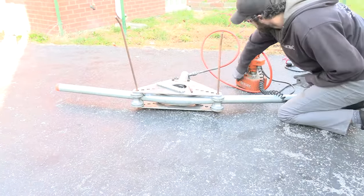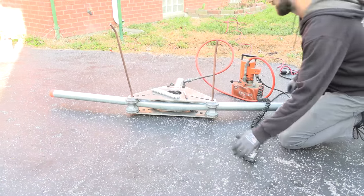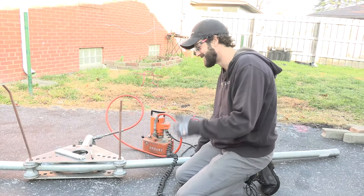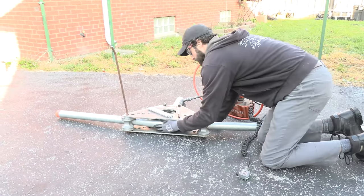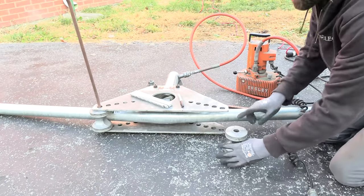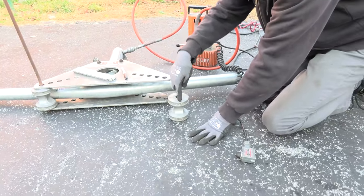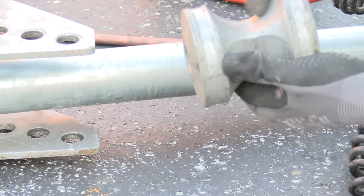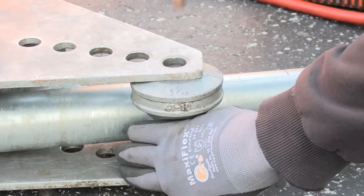All right, release the pressure. And my ground rod's held. That is so unprofessional. All right, pressure on the head is slowly coming off. One thing to note is, this is just Sharpie down here, but this has got 4 settings. It's for 1 inch, inch and a quarter, inch and a half, and 2 inch, and I've got the 2 inch dip, which matches the curvature of the pipe so that it settles in there real nicely.